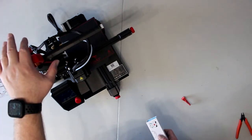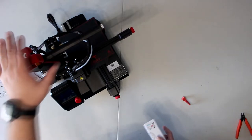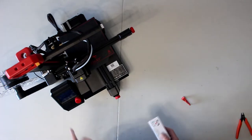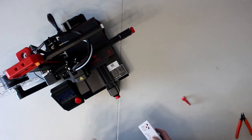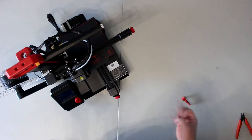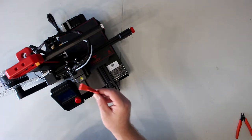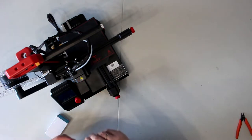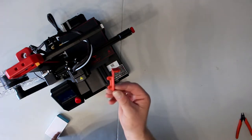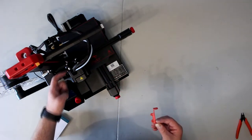Finding the drivers from Creality was a little bit harder to find, but I was able to find them. Creality does make it for this board — this needs to be a 32-bit board; an 8-bit board you cannot do it, but this is a 32-bit. The only thing you need to get is a 3D printed mount for it. I found this one on Thingiverse.